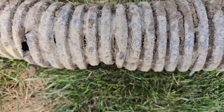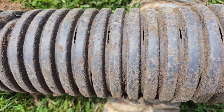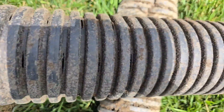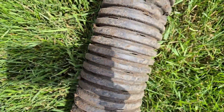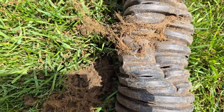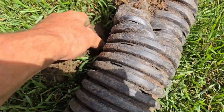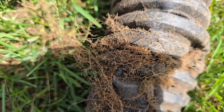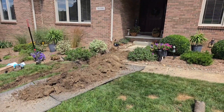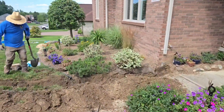This is four-slot staggered — they used saw-cut perforated pipe, four-slot staggered. They didn't use solid pipe. You can see how the roots in the landscape got inside the pipe. I don't know how filled this pipe is with roots, but there really isn't a big tree here — it's the shrubs. Had there been an ornamental tree like that one, it would have been clogged for sure.